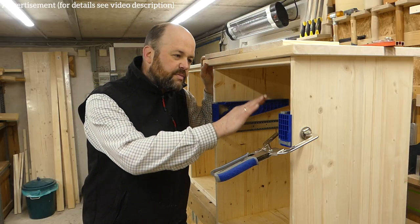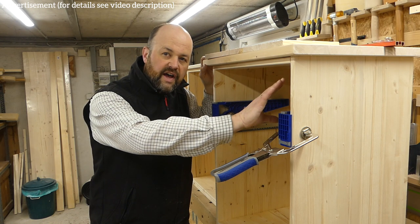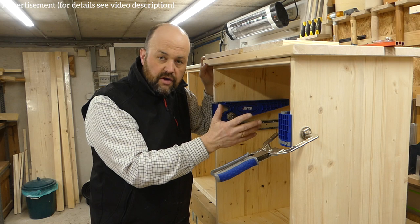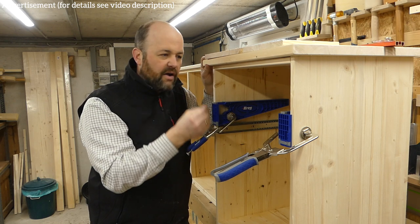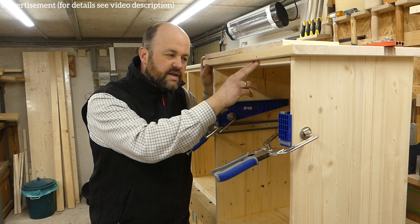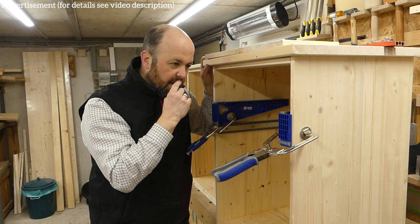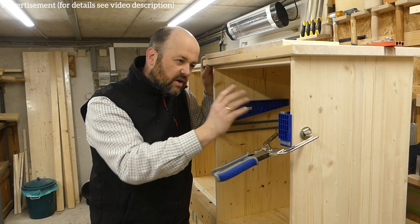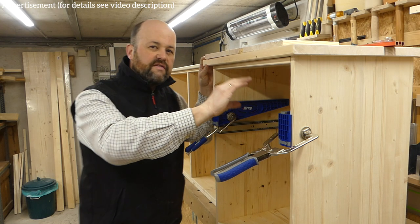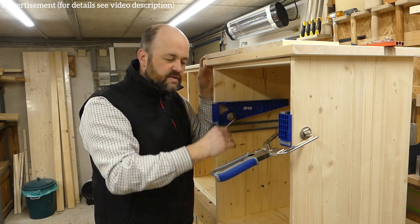Well, just as I was about to install the second slide, I double-checked the height of the future drawer, and it turned out it is too low. Well, thinking about it, when I lost those 3.6 centimeters, because I made that mistake I talked about earlier, I lost basically all the wiggle room that I had to have some gaps between the drawers and the boxes.